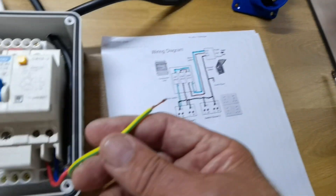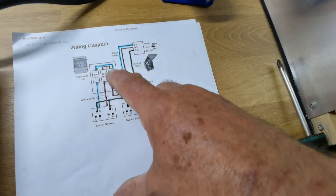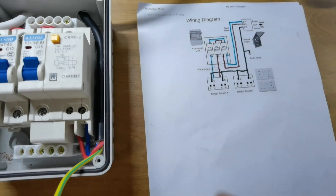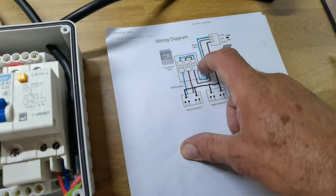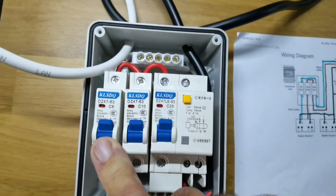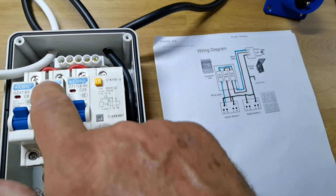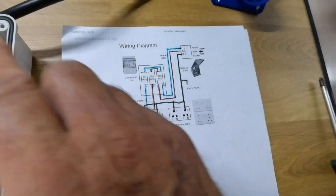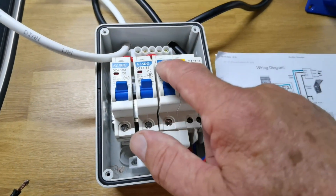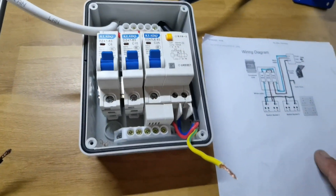So it's saying it comes from here — this black cable — so that's my earth strap, that's my earth coming in. I've also got a separate earth. Then it says connect your live and your neutral: neutral this side, live this side. Then what it's saying is you come out at the top and put your neutral from this big one to this one, and then put a live from this one to that one.